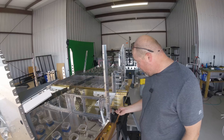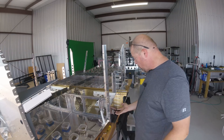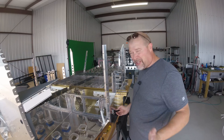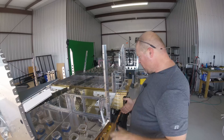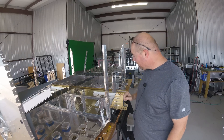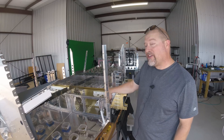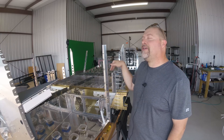Once it's in there, it's right here. I'm going to have to put the whole skin on here, which shows me where those four holes are that I'm going to have to drill — start at a number 30 and then up-drill it, probably to a number 12. Then I get to do it all again on that side. Don't put the shim in and then try to put the bolts in — take the shim out, put the bolts in, then put the shim in. Otherwise it's just a total pain.